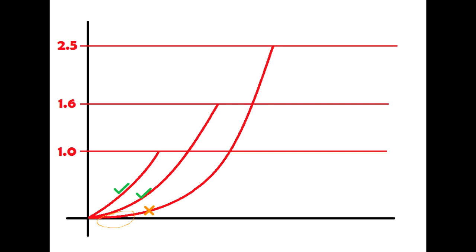This is where the pole changer motor comes in. A pole changer motor is a 6-phase AC non-synchronous motor. It's just like a regular 3-phase AC motor, but with 6 phases. And how you wire up the phases gives you 2 different speeds, effectively 2 different frequencies without having a variable frequency drive. This means you can run your lift or crane at 3 different speeds, but we're not going to talk about the slow leveling speed yet.